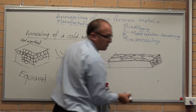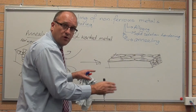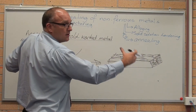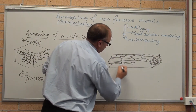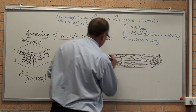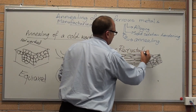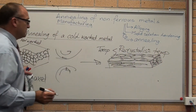I have got grains that look like if I got a long pancake or a long bit of Turkish bread and sliced it through. Actually, Turkish bread is probably the best example — a nice round grain becomes something long and flat. And crossways, I'm seeing long and flat. This is cold-working. Temperature is less than the recrystallisation temperature.